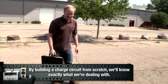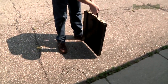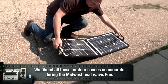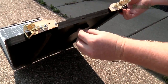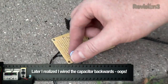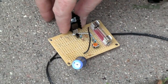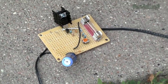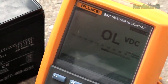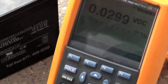Since I love making portable things, I made a portable solar cell unit. The DC power from the solar cells comes into this charging circuit. We had a capacitor on it but it got blown, so I don't think we need it. There's a fuse and an adjustment, and an adjustable voltage regulator that self-adjusts, and it connects to the lead-acid battery right here. Let's check the battery voltage first — 12.427 volts. Now let's hook it up to the charger for a few minutes and see if it goes up.